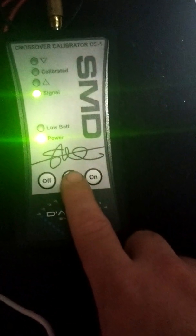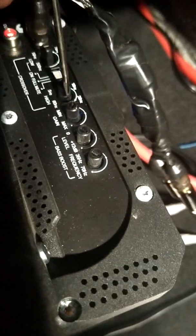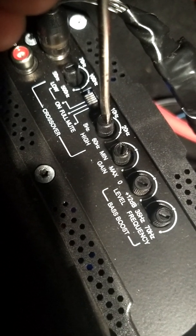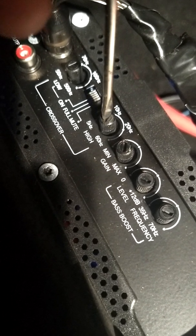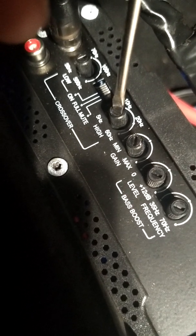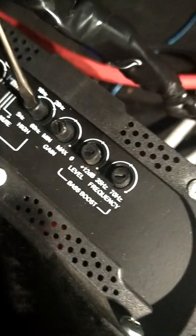We got a signal right there. We're going to hit read again. It's reading. Now we go over to where it says infrasonic on mine — it's labeled high because it goes from five to 60 hertz. I've got it at five. We're going to turn it up to that 20 mark. Passed it right there — so we're right on that 20 mark. Fairly close to 20 hertz and it shows perfectly calibrated once again.